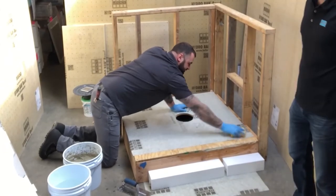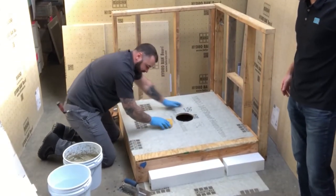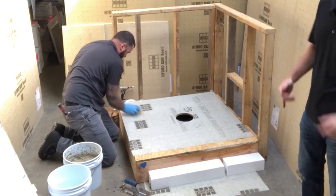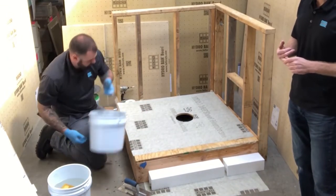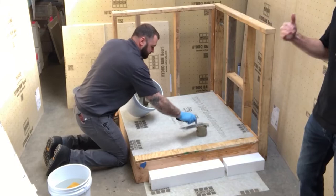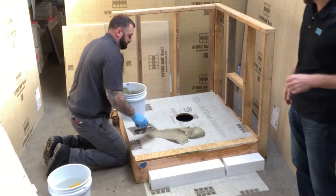All right, so getting back to the install portion of this thing. Okay, Glenn's wiping down the substrate, as you would in any good tile installation. A couple quick things on substrate for the pan. Obviously concrete, suitable. 3/4 Advantech style underlayment, suitable. Do have the ability to recess your joists, drop sister in 2x4s, drop your main flush to the top of joists with this style pan.